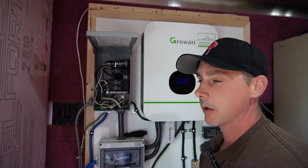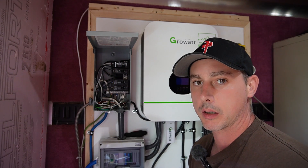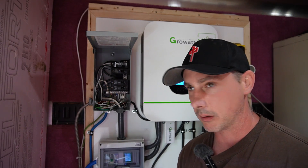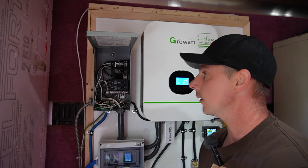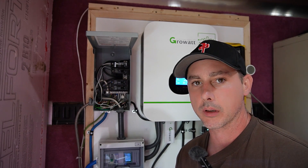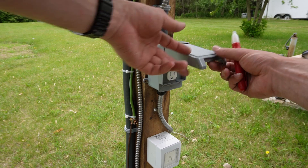To test this I'm going to fire up the Growatt and see if this will trip and act like a proper GFCI. Okay, firing up the Growatt now. My panel is now live, so I'm going to flick on the GFCI and run a test — and it works. Now we'll go outside and check the outdoor plugs and see if they're live as well. And we have power outside, GFCI protected.